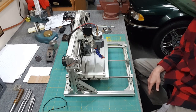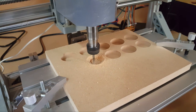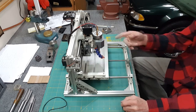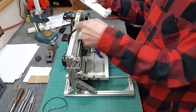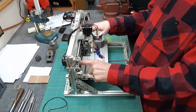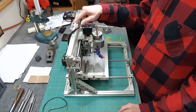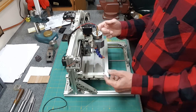Here's a sample video of it running — that's making an ER32 collet holder and I had to do it in three sections because the second limitation is the size of the table. So what I was trying to do to strengthen this — I've already made part of it. This piece is going to go on the inside and bolt to the back. The two rails will come off, and that lower piece is going to drop and hold it. It slides real easy, no play, these aren't going to flex. So if this works, my next step is to pull the whole head out and drill all the holes to attach it.